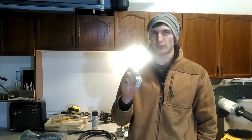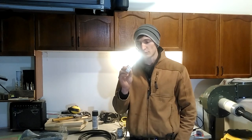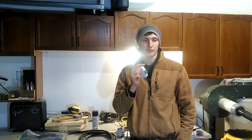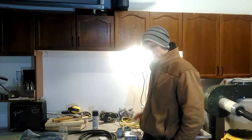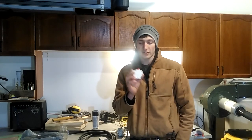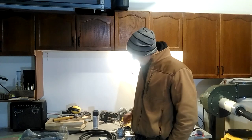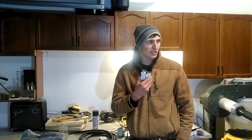And what I've got is a 30 amp breaker — a dual pole breaker. That means that it hooks into two poles on your panel. What I did before I went to the store is I went down to my panel and made sure there's enough room on it to accept this breaker. While I'm running that wiring, I'm going to run another 20 amp circuit so that I can add a couple more regular plugs.